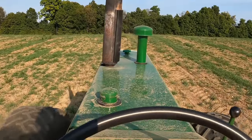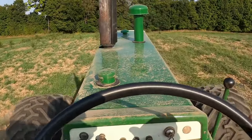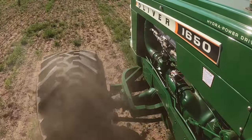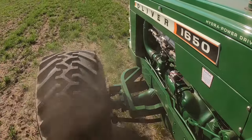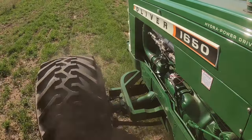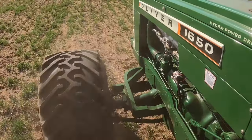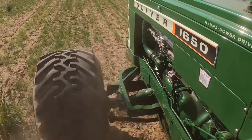And the right fender is tweaked pretty good, the fender tank. I tried straightening it out, and there's so much steel in that, I finally just shimmed it instead. And the right tire looks like it's slightly newer than the left tire. So I'm thinking when that went, it probably damaged the tire and they had to replace that. It damaged the fender when it broke off and hit the hub or came around and tweaked that some, but they lived with that. I just couldn't stand that look. Eventually I shimmed it, just some flat washers under the mounting bolts. And that definitely took care of the appearance problem.